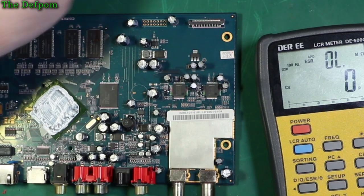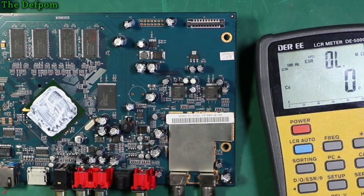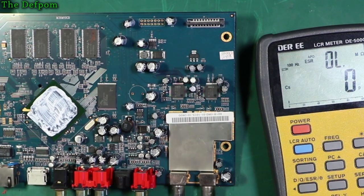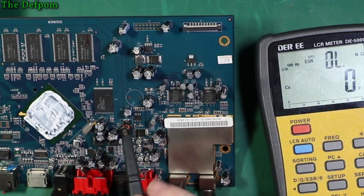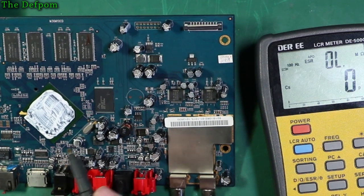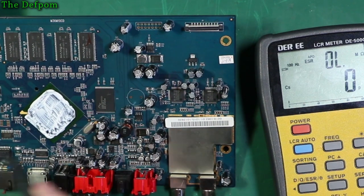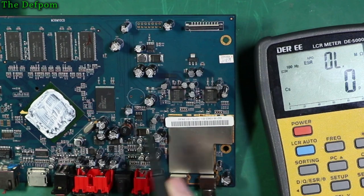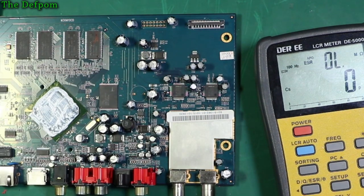7. I might just try and see if I can get the right parts in. Get exactly the same ones. Yeah, it's all the same ones that's gone. So the 10UF 25 volt. Every single one of them is the same part. So if I just get a bunch of those, I need at least 10, I think. Just replace all of them. So 3, 4, 5, 6, 7, 11 of those caps, even though some tested okay, I'll just do them anyway. Right, I'll get 20 of those caps in stock and go from there.